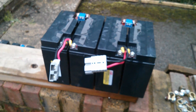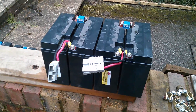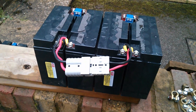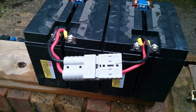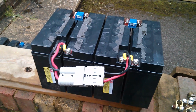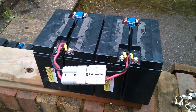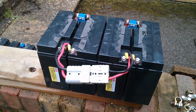I've got four of these packs — two more down there. So I connected these two battery packs together, just for a laugh. What's interesting about these connectors is that they're not like regular polarized connectors — black connects to black and red to red, so I've connected these four batteries in a series-parallel arrangement. If they had been regular polarized connectors, I'd have had a 48 volt bomb on my hands. Those wires wouldn't have lasted five seconds — well, the fuses would have blown of course.